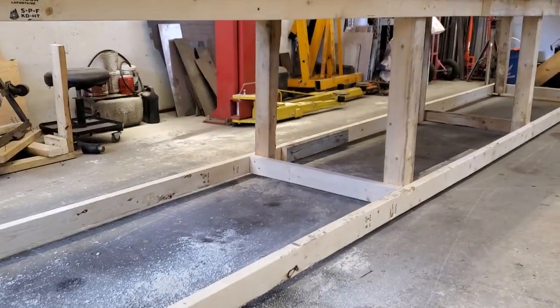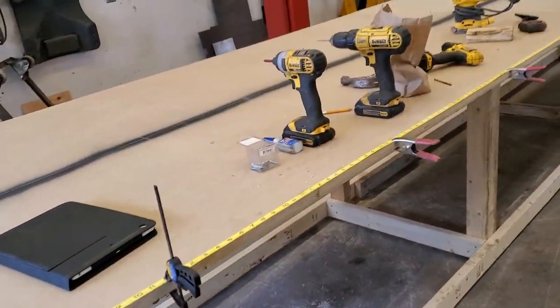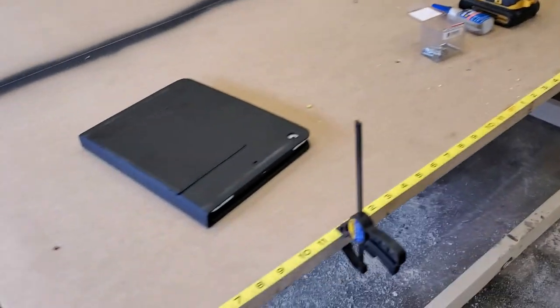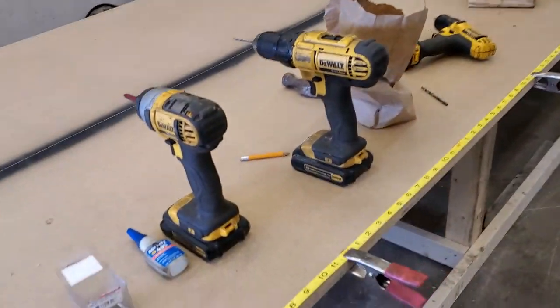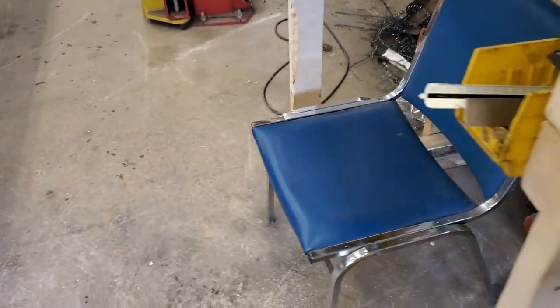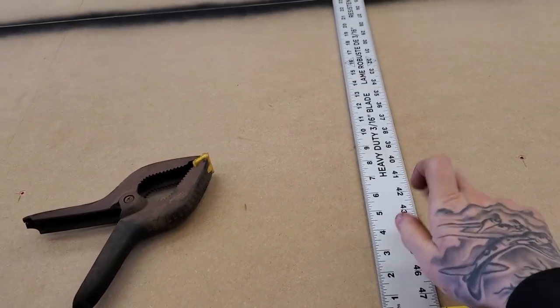The table is two-by-six top with four-by-four legs, and I've got 5/8 studs in the legs for leveling. I cut off a hundred-foot tape and glued and screwed it onto the edge. For the centerline down the table, I just stretched a string down, clamped it at either end, and walked down with a can of spray paint. That gives you a centerline and a tape that doesn't move, so measurements are always from the same place. You can also take a square across wherever you want.